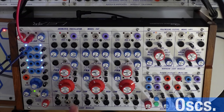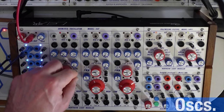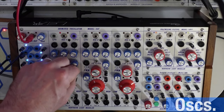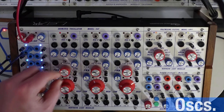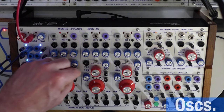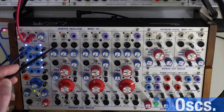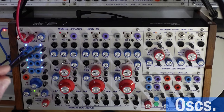Scaling is in here. You have linear FM, which I really like, especially in the Buchla world. So that's built into the actual 3340 chip. There's hard and soft sync, which you can blend here to make it sync harder. And what else do you have? And then you have all the buffered outputs and internal mixer per oscillator, which is super cool.